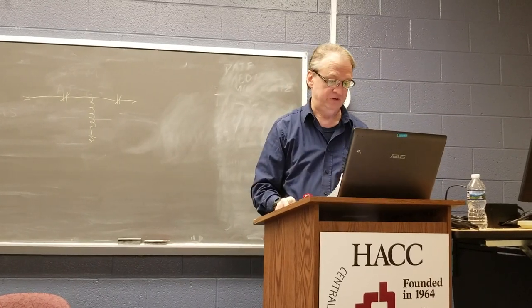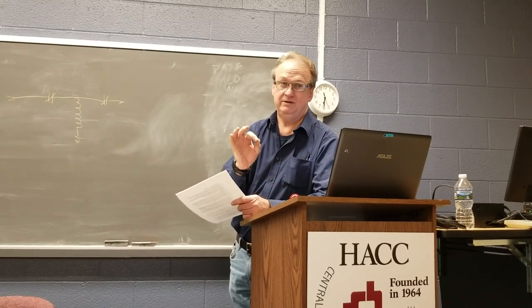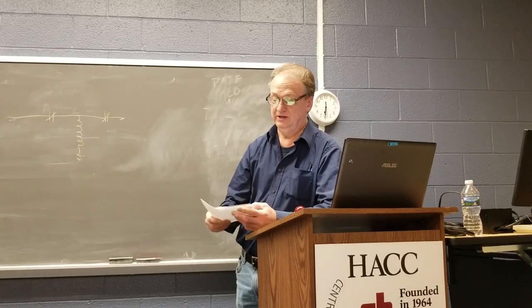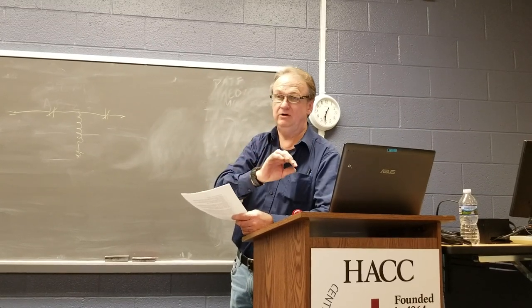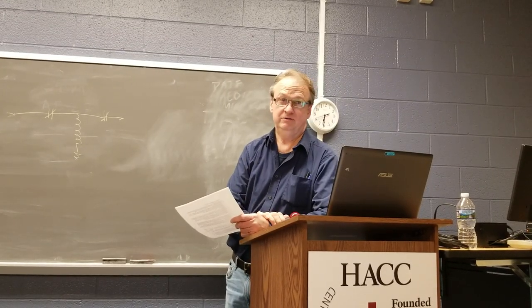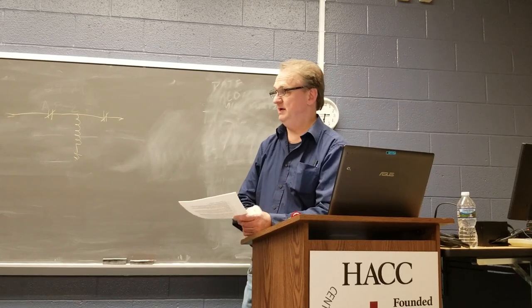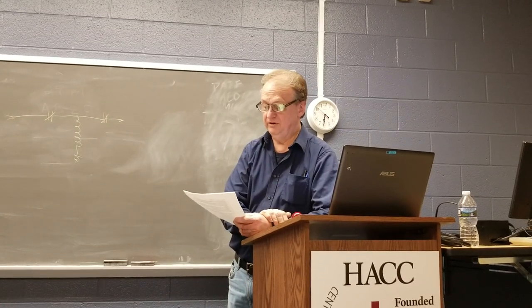When we build broadcast facilities, it's called an ATU because we don't have the tuners inside the building, they're outside, out at the tower. The reason for that is really kind of simple. You want every watt that your transmitter is producing in a broadcast facility to be radiated. And the best way to do that is have it tuned so that you don't have any loss in that cable feeding the tower. And you really want that in ham radio too. If you're trying for DX and you're in a pileup, every little bit extra that you can put into that signal helps. So that's where we'll start with this discussion.